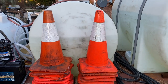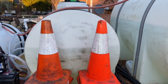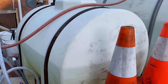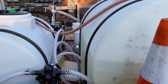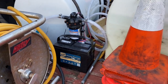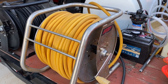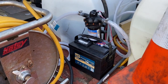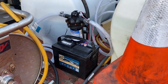Two cone holders for commercial jobs or gas stations — anything we do at night or when somebody's still open. That's 125 gallons of chlorine, soap, and water mix for roofs and post-treating concrete. That's a 55-gallon degreaser tank — also a mix — with a little electric pump running through about 275 feet of soft wash hose, which is about as much as you can fit on this reel.